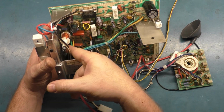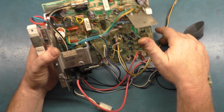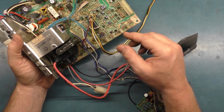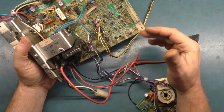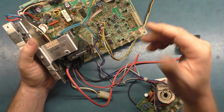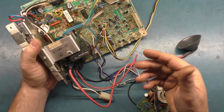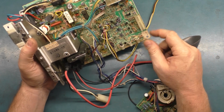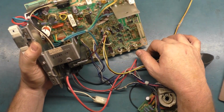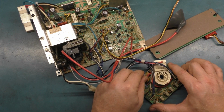We just needed to add that capacitor and that diode and change this out to a 002, and the problem is fixed. Now I'll hook this back up and we'll go through it and show you. I'll turn up the brightness and contrast and the B plus won't dip anymore. It'll be nice and solid when the screen transitions, like an MK. If you go back and watch the video, if you haven't seen it, you'll see the terrible screen jumping, and the B plus was dipping down to like 105 or 107 or some crazy low number. And if you let it go for too long, it would take out the HOT. So yeah, that's all it needed. I'll get it back on a tube here and we can go through and witness that it's now operational.